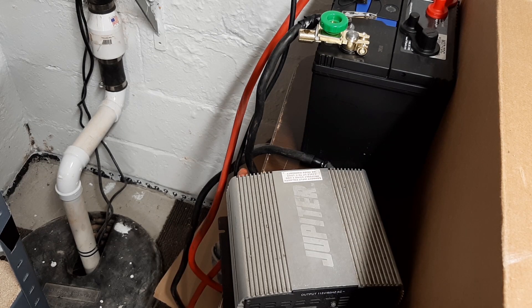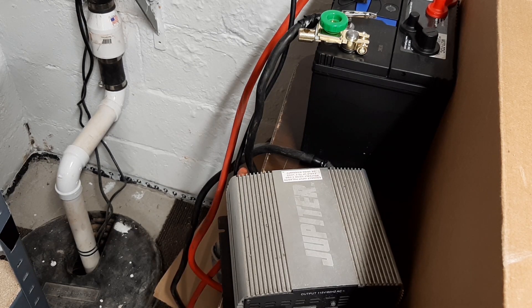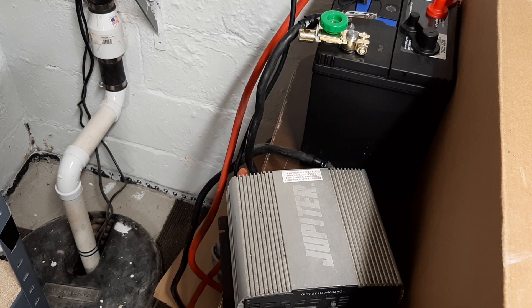Would I feel more comfortable with a 2000-watt inverter? Yes. 2000 watts basically replicates a standard outlet - a standard American outlet in an average house is about 1800 watts, which is the most you can pull before you pop a breaker. So if you want to replicate that and then some, don't go 1500 - go full 2000. Then you just don't have to care. And if you're really going to do it right, get a true sine wave one. Unless you're trying to save money - you either do it budget and get it done, or you super do it the right way.